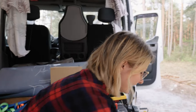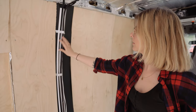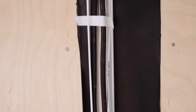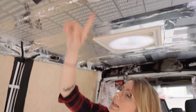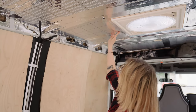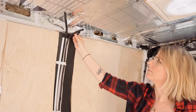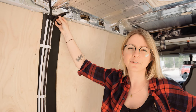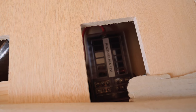Last time we did some cable management — we installed a plastic conduit for the cables and put in the cables from the company that did the power setup, but also our own cables that go to the lights. We've already put in the one that comes from the vent. It goes into this protective conduit all the way down to our setup — it goes to the 12-volt terminal, it's just plus and minus, and it works.